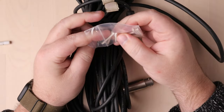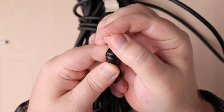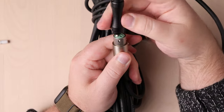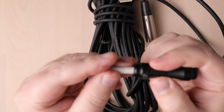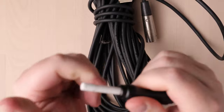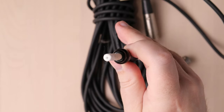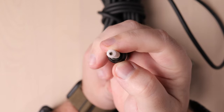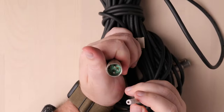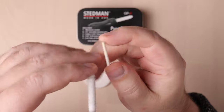How about an XLR cable? We'll do female first, as it should be. For this, we'll use one of the small XLR terminal cleaning tips. We just use the opposite side of the handle and plug one in, then use a single drop of deoxit. Give it a twist — yuck. Now for the male XLR side. For this, we'll use the same quarter-inch microfelt cleaning tip, but install it the opposite way with the tapered end connecting to the handle. Then we'll add a single drop of deoxit to the tip and twist away to each of the three pins. Look at the grime cleaned off from each one — the microfelt attachments are filthy.